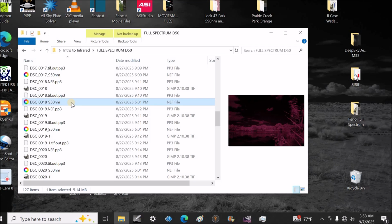Now with the conversion I'm going to do with that other camera, where I said I'm going to put an 850 nanometer filter in there, it's just a little rectangular filter. I'll get a picture of it and show it to you. It'll be over the sensor only. So the smaller sensor that is used for autofocus and for the light meter is not going to be covered up with infrared light. But my exposure time is very likely going to be messed up. My autofocus, when I use that one, should be better.